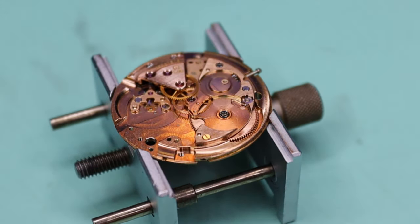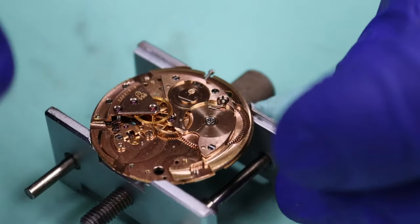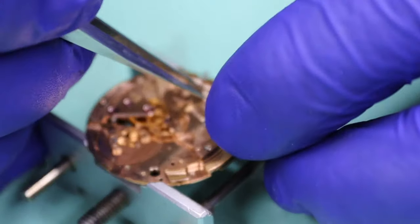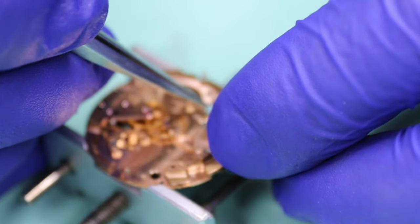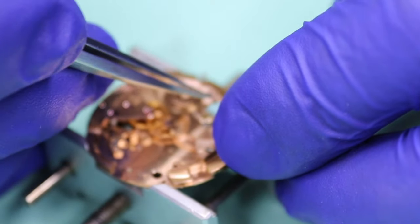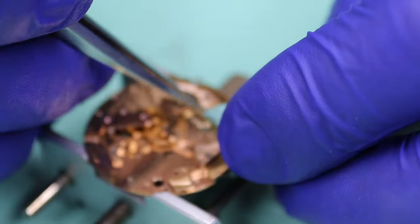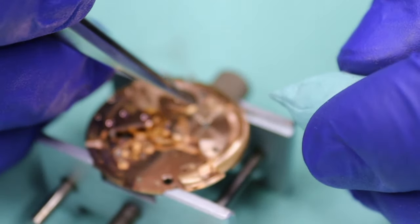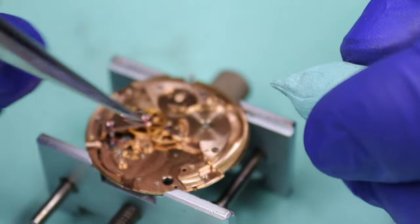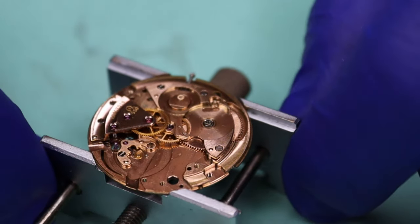Okay. So you don't lose the spring and click, I like to use a piece of Rodico and hold it over the click spring. Remove the click, and remove the spring. That way, this thing is always under tension when it's installed. So when it goes to jump out into the universe, you got it with Rodico.